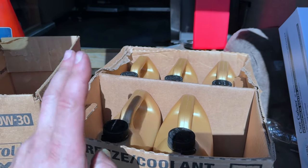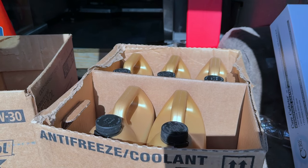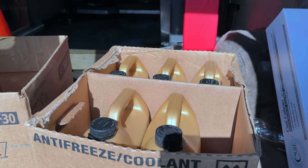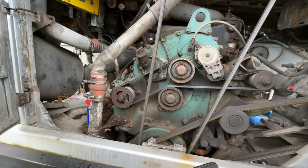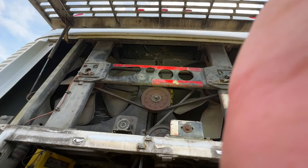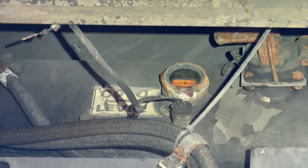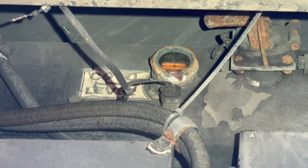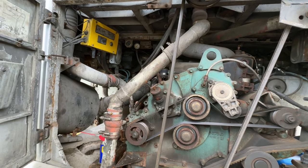$130 later, we have five gallons of concentrated diesel coolant. That's nowhere near enough, but at least we'll get enough in there to tell if anything's leaking. So this is me happy — we just put 15 gallons of coolant in and check it out, right up here on the sight glass we are just seeing a little bit of coolant. So we got away without dumping the entire system.